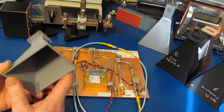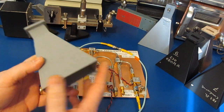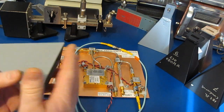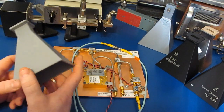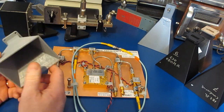Of course, when we're looking at the radiation patterns, that's a relative measurement. So it doesn't require any kind of calibration, but to measure VSWR, where it's an absolute number, now we have to calibrate the instrument, and of course that raises some questions even how to make that measurement. So I'd like to go over that as well. And the last thing I'd like to go over is possibly using the waveguide to identify different materials.